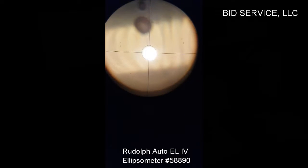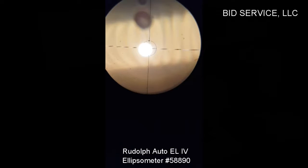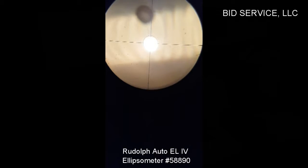This is the view of the bright dot through the auto collimator's eyepiece. I'm adjusting the right and left alignment knobs to move the dot. By tightening the left knob, the dot moves towards the left, and by tightening the right knob, the dot moves towards the right. Sometimes it may be necessary to adjust both left and right knobs simultaneously to center the dot at the crosshair. There is also a knob in the front which moves the dot up and down.